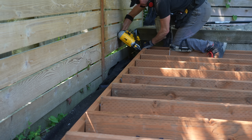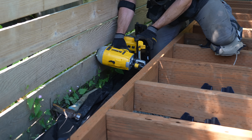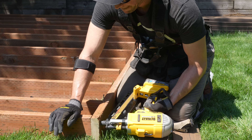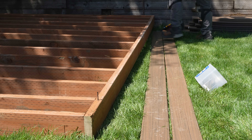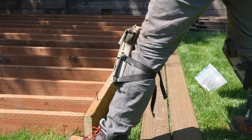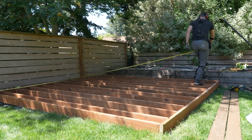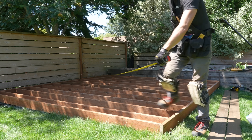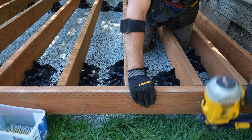As mentioned, the first two boards are cut exactly at 12 feet and each joist is laid out at 12 inches on center except for the ends. The end boards are at 8 inches because we want them completely concealed from the exterior while also being as close to the ends as possible for proper support. I nailed off all the joists along the back side of the deck across the fence line, then gave the entire system a few love taps to get it as close to the fence line as possible. Prior to nailing off the remaining joists on the opposite side, I take the cross-dimensional measurement to guarantee a perfectly square deck.